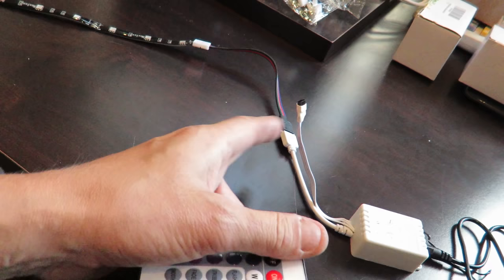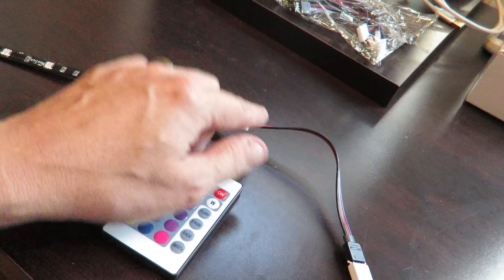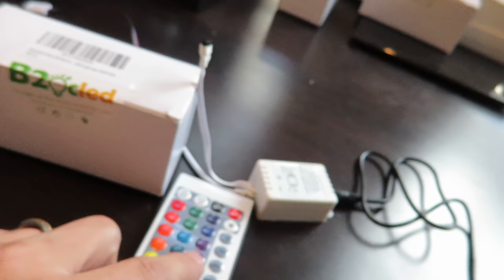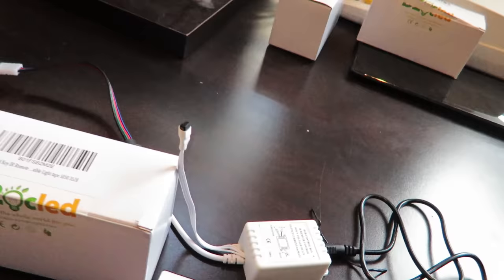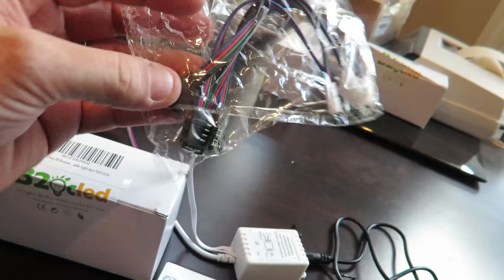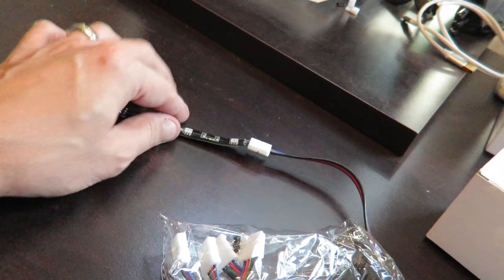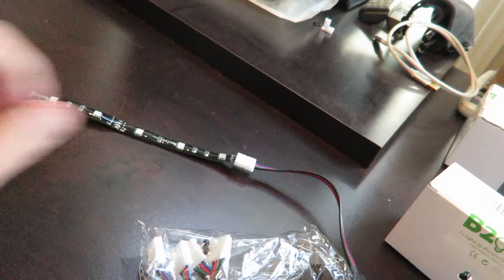So it works with this simple little adapter right here. All you have to do is buy this little power pack with remote control, and that I bought right here. And I bought this off of Amazon. I'll leave the link below. This whole kit right here includes the remote control, this power adapter, and cord. And then you'll have to buy these. They come in packs of, I bought packs of 5, where one end is black and the other end is a white clip that opens up. When you strip off this LED, like I'll show you, you slide it in here, and then fold the clip over, and you're done. You have another whole strip for under $11.